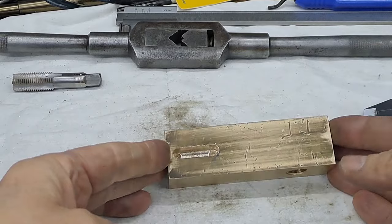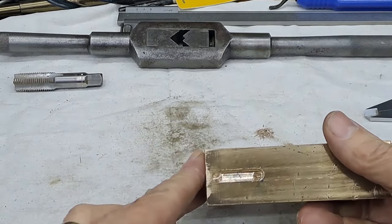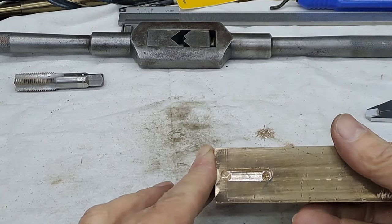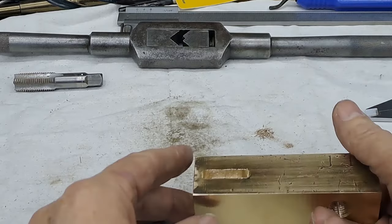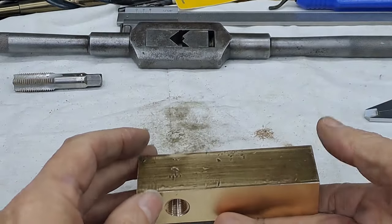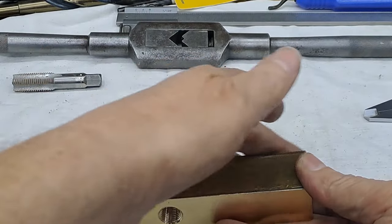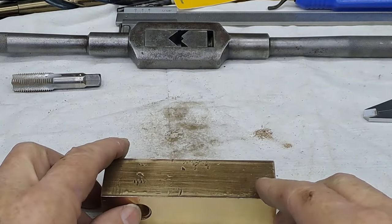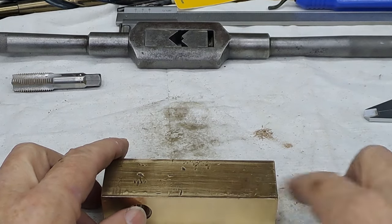There it is. You can see I drilled deep enough down so that the slot drill always had a bit of clear space underneath it. We'll get this the other way around into the vise now, so at least we're referring off the same face up against the fixed jaw in the mill vise. Then it's a case of coming in 66 and a half and then 28 and a half, and ditto repeat.